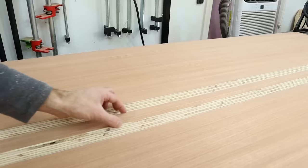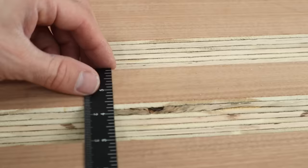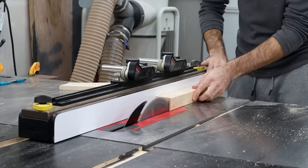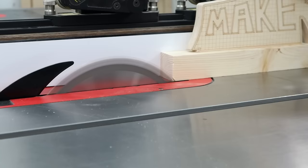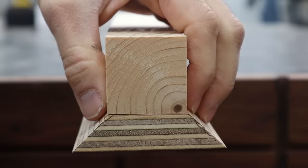I was recently building some floating shelves and needed to cut pieces to match the internal dimension of the shelf. Beginner John would have measured it, maybe twice but probably not, set my table saw fence, and started cutting the actual wood. Instead, I used a scrap piece of wood and took multiple cuts, nudging the fence over each time until it was exactly what I needed. It's possible I could have nailed it the first time, but highly unlikely.